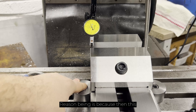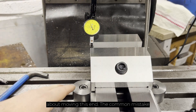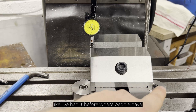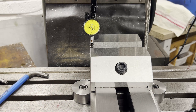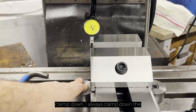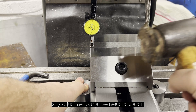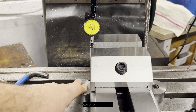The reason for that is because it provides a pivot point for the rest of the vise, so you only have to worry about moving this end. The common mistake is people either nip up both clamps, or they haven't clamped it at all — they get it perfectly parallel on the table, and then when they clamp it down it moves. So you don't want to be chasing your tail like that. I always clamp down the left hand side clamp, but that's only because I'm right-handed, so any adjustments that we need to use our trusty mallet for are always on the right side.